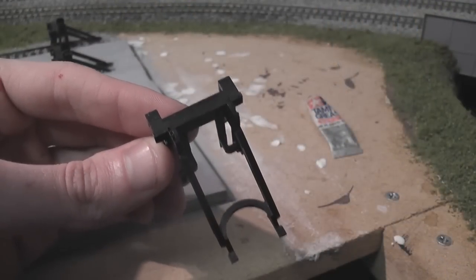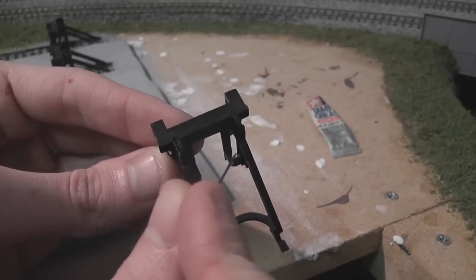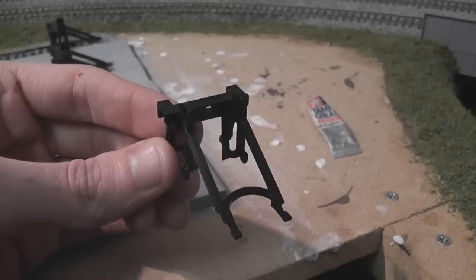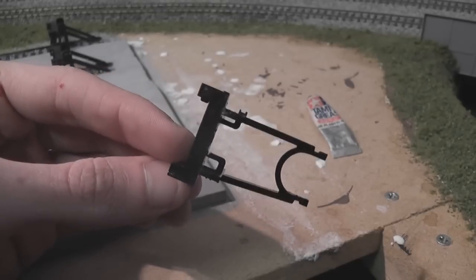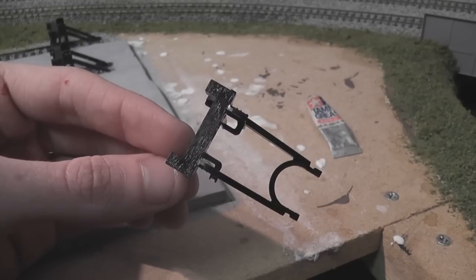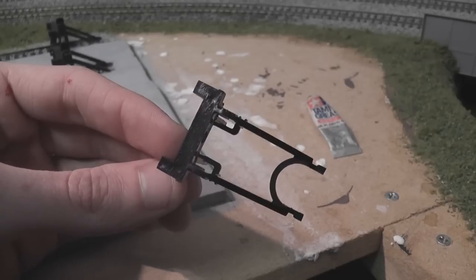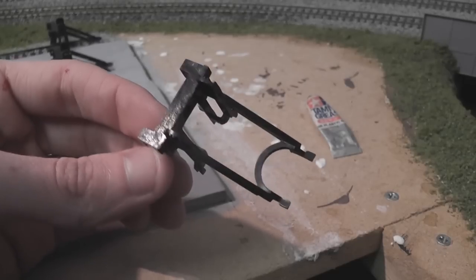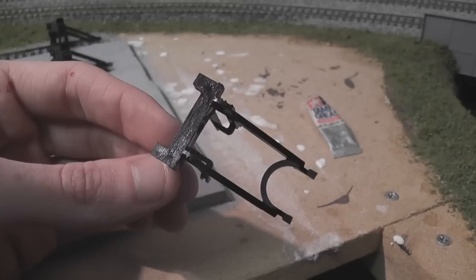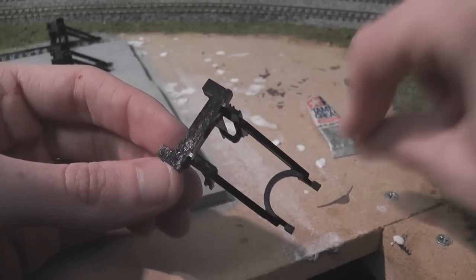Right, okay, for putting the wires in, you can probably see just there where the needle's pointing, there's a little hole that runs down the buffer like that. See the two slots? They're perfect for slotting the wire down. So I put the wires down there, doesn't matter which way round, and then I push the LED through the hole, and that disguises that it's there. So I'll just quickly put those in, and then we'll check it works.